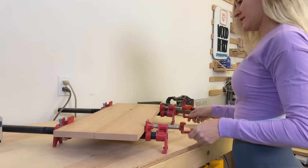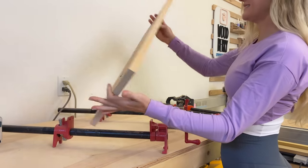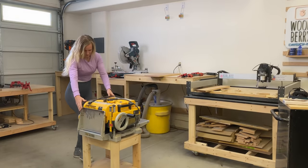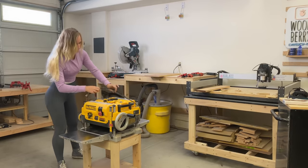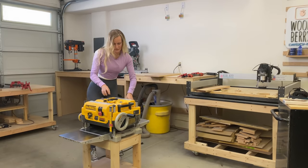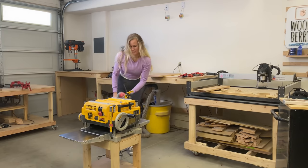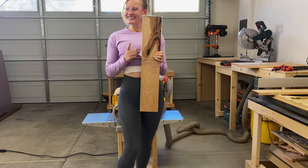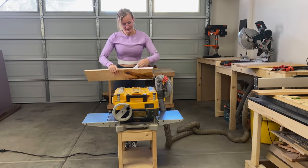The glue has fully dried — it's time to take off the clamps. To make the boards perfectly straight after the glue-up I'll use my planer. The resin has fully cured as well. I'll run both boards through the planer at the same time to make sure I get an even thickness on both parts. Here's a little tip: if your vacuum hose won't stay attached to the planer, use a small clamp to attach it — it will also help keep the hose tucked away. Make sure you take off as much tape as you can before running the board through the planer.